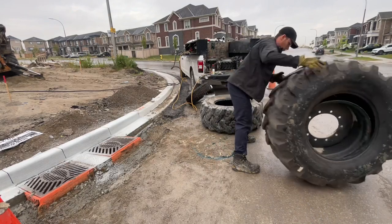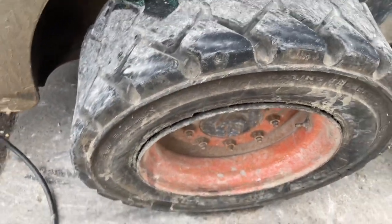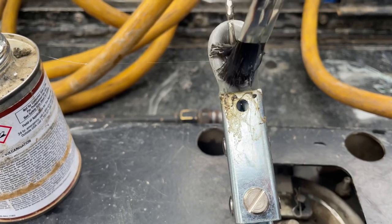It's even heavier in the rain. Looks like we got another Bobcat flat tire — got a big hole right there. What I'm going to do is, before I air it up since it's off the bead, I'm going to put a good plug in it, let it dry for maybe a minute, then air it up. The bigger plugs are what's needed for a big hole. Now I've got to put a little bit of glue on it — that's what makes it work.